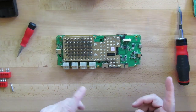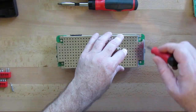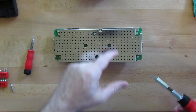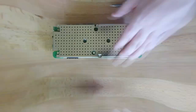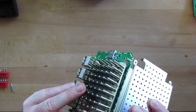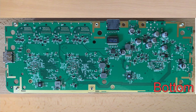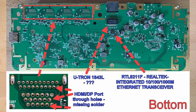Let's flip this over and remove the RF shielding from the bottom. There are six screws, highlighted in blue, that hold the RF shielding to the bottom of the main board. With a bit of patience, the RF shield was free. We're going to start with the bottom half of the board, since the heatsink is still attached to the top. The bottom is very busy, but mainly with discrete components and two chips. I was able to identify one of the chips, which was part of the Gigabit Ethernet adapter. I also want to call out the soldering on the through holes for the DisplayPort/HDMI connector — the holes are not completely filled with solder, which could lead to integrity issues since these are the main structural supports holding the ports in place.